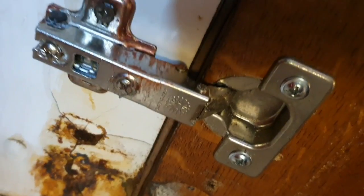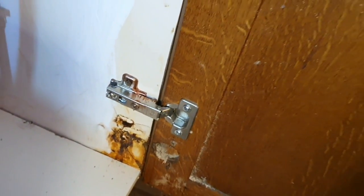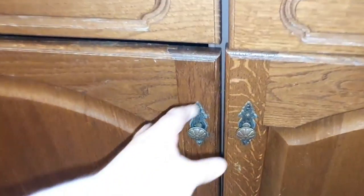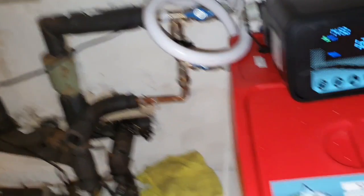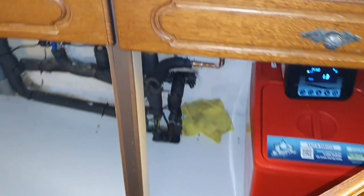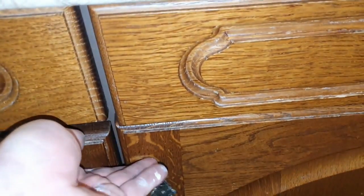To address the door — as you can see it's damaged at the bottom of the cupboard — the new hinge wouldn't be able to fix there, so I've moved the old hinge up a little bit and it's as good as new. The last thing we did was seal all around the base of that cupboard to make sure no water can get underneath again. We've put in a 10-litre water softener — you can see the new full bore valves there, so you've got no restriction. That 10-litre softener will do a family of four easily, but this is just a couple and they don't use too much water. In that area at 360 parts per million they get around about 1,300 litres per regeneration.